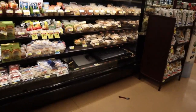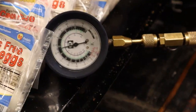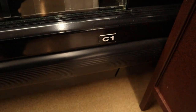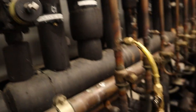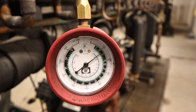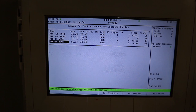Here at the case, still feeding from the distributor. Suction is at 55 pounds — it would have been reading 66 if we didn't open it up. 20 minutes later it's still 55. Liquid is now down to 60 pounds — that's as far as I'm gonna get because the rack can only go down to 57 right now.